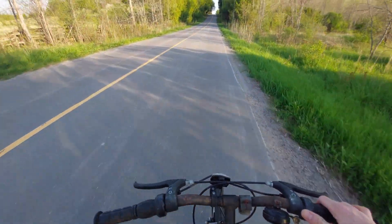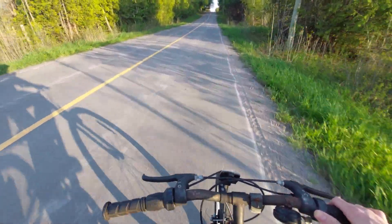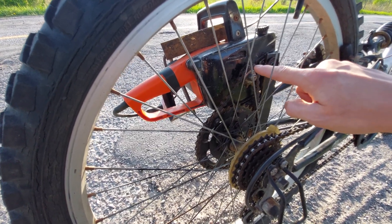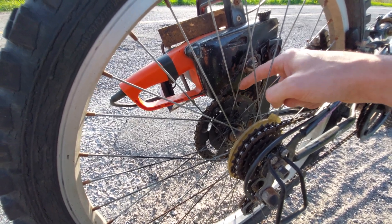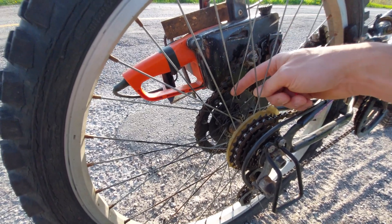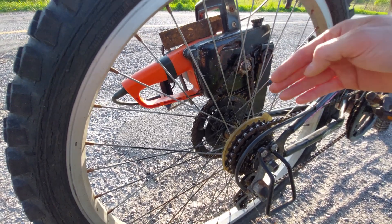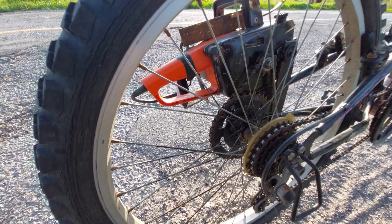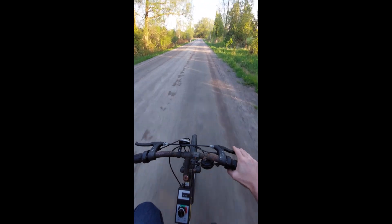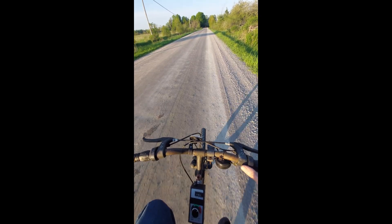It's not super fast. We need a bigger inverter — if I had a 1500 watt inverter connected to this, I'd like to see what it would do. You can put a freewheel sprocket on as your pinion, but you'd have to mount that sprocket right to the hub, so you're going to weld again. The other option is attaching it to the spokes, but that's the worst option — they call them spoke rippers — because the chain is always going to be turning.